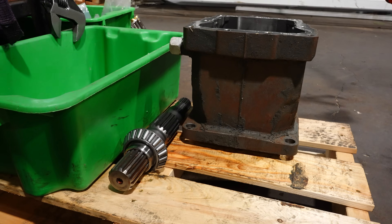What do we mean by filling the case? The case is just another word for the housing — that cast iron cube structure where everything goes inside. When it gets installed onto the system, they need to remove a plug and pour hydraulic oil into the case so it fills up. They also need to bleed out the air to make sure it's 100% filled with oil. They do this because the surfaces inside need to run against each other with a coat of oil in between them.